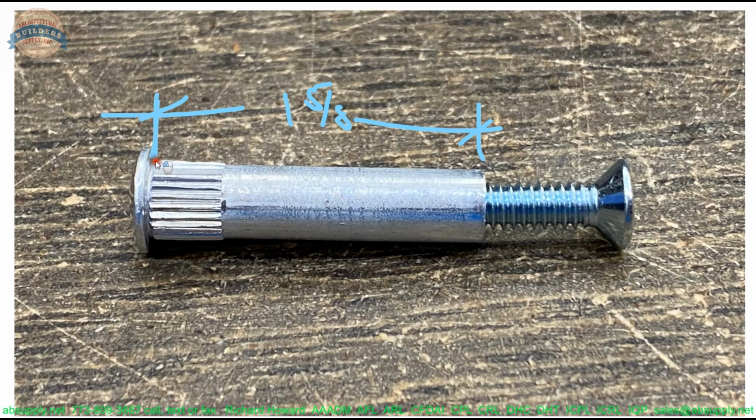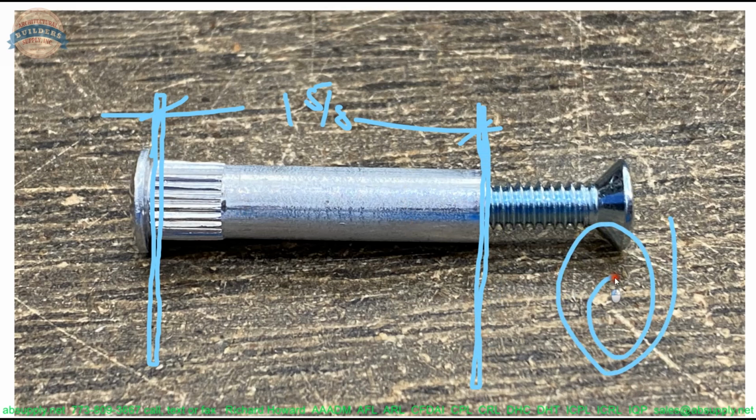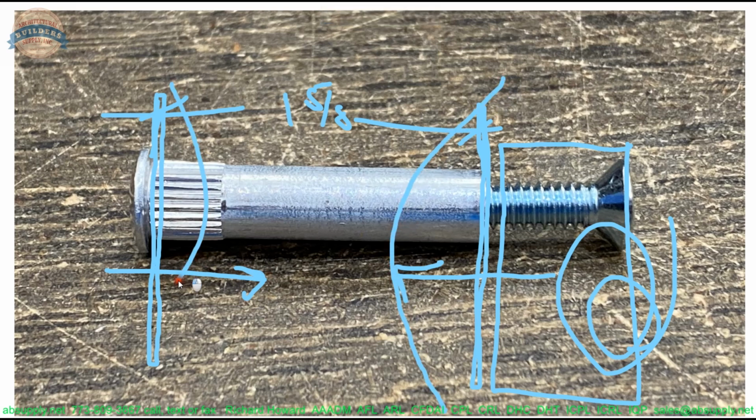Well, you've got your metal door, and it's very thin, meaning the wall thickness is thin. If you measure the outside of the door to the inside face of the steel over here, it's about 1 5/8. So as you take your bolt and tighten it clockwise, as the closer, which is clearly sitting here, and all this is tightened, it's going to draw this together. That tightening will want the door to bow in and to go concave. Well, the length of that right there prevents that from happening.